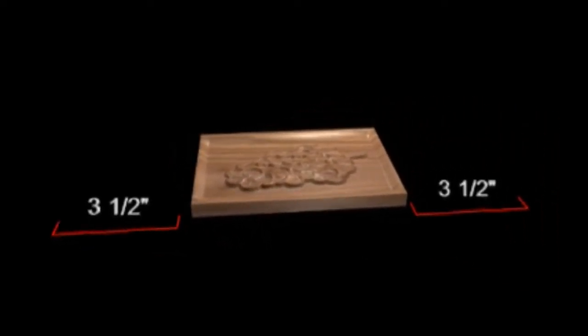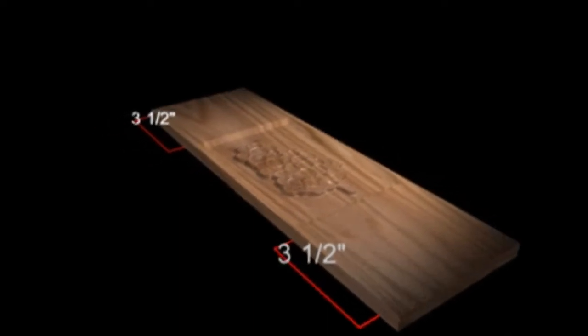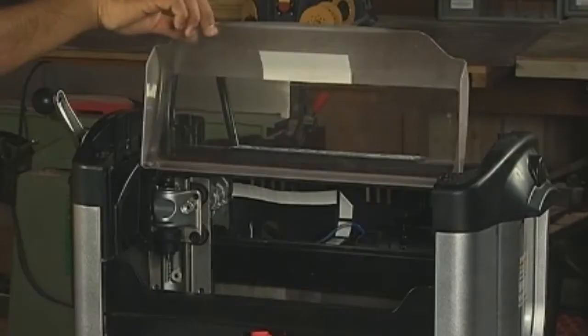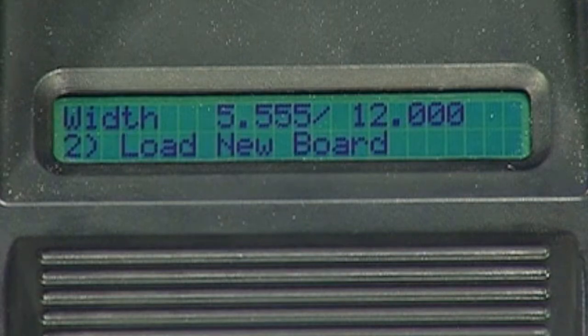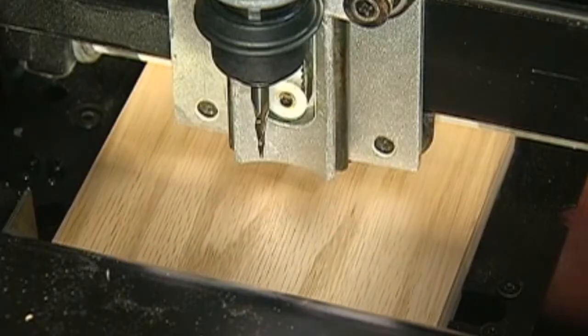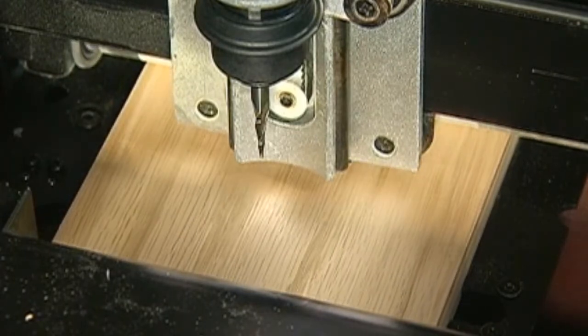If Yes is selected to stay under rollers, the machine will automatically assume there is a 3.5-inch extra length on either side of the project, meaning the workpiece must be at least 7 inches longer than the length of the board specified in the designer software, or a jig must be used. If the board does not account for this extra length, the machine will ask if you want to scale the project or insert another board. It is recommended that you insert the right-sized board, because scaling can have some unintended consequences. On our project we will select Yes, stay under rollers — this is why we need a 19-inch board to complete the 12-inch long project.